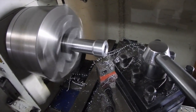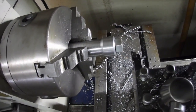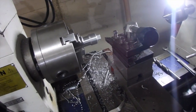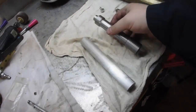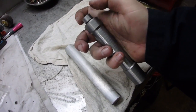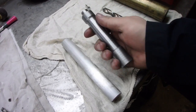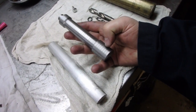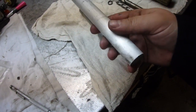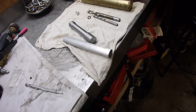I think I got my groove right where I need it. I've got the ORB fitting in there, but I don't really like it being hexed like that, so I'm going to try to machine it down smooth. We're on stage 2 now — this piece is done for the most part. I got my cap in there; it's going to relieve the pressure so you can slide the piston out, or tighten it up so you can have compression to ignite. Now we're going to make the piston out of aluminum, so we're going to throw this in the lathe and start machining it down.